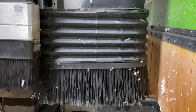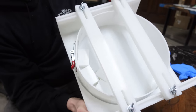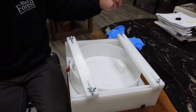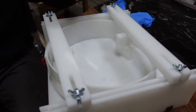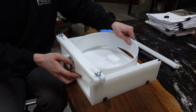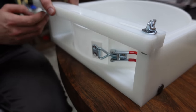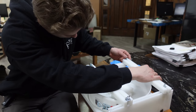If you guys don't want to go to all that work, or if you don't have a CNC machine to cut things round, we now have round reusable epoxy forms. Essentially, these hold-down bars loosen so you can move them out of the way, put your wood inside, and then use these little hold-down blocks. You put your hold-down block in there, clamp everything down, stick a little wedge in, and then you've secured your piece. Then all it takes is a bead of silicone around the inside of the groove, plop your piece in, slide your hold-down bars on, and you're good to pour. Check these out on our website — similar to our no-seal forms, except these are round and you have to seal them.